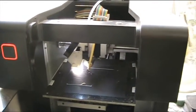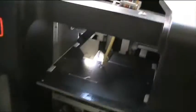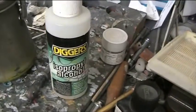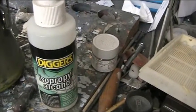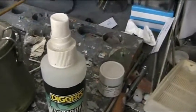What I forgot — maintenance. I watched a few YouTube videos reviewing and demonstrating the use of this product, and if you use spray isopropyl alcohol on the surface of your Buildtack after it gets a bit dirty with a build-up of plastic, it cleans it off immediately with a bit of towel — evaporates immediately. So every 4 or 5 prints, spray a little isopropyl alcohol and you are good.